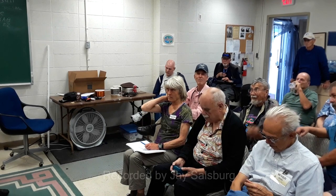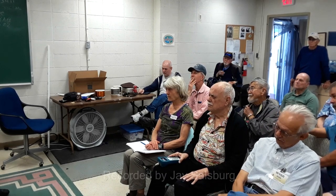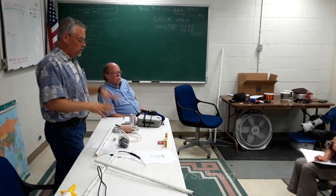So there's a couple things I would say right off the top. A couple things of safety. Anytime you have a lead acid battery, liquid wet cell battery type, you have a corrosive agent in there. So if it tips over, you have to be aware of that. The other thing is, anytime you're charging, there's a possibility of it putting off hydrogen and oxygen, unless it's a sealed battery. Those are less apt to do that. So if you're in an overcharged situation, it could be off-gassing hydrogen and oxygen, and that could be combustible. And sulfuric acid. Make sure it's properly fused, because you don't want it to short out on something and cause an electrical fire that way either.